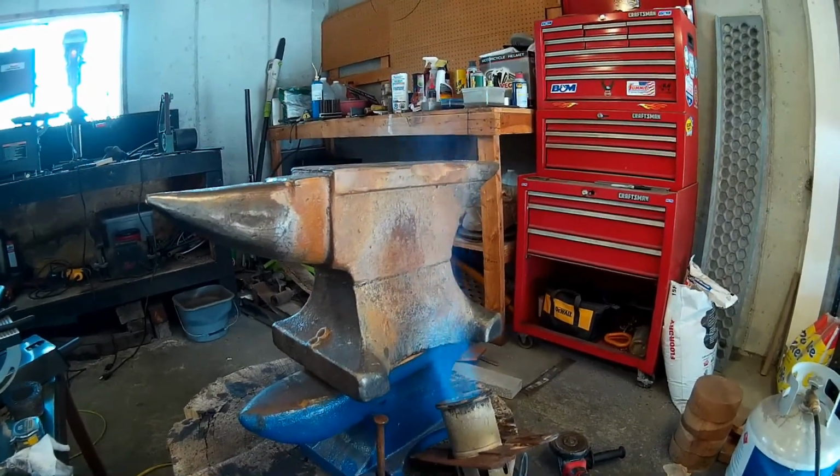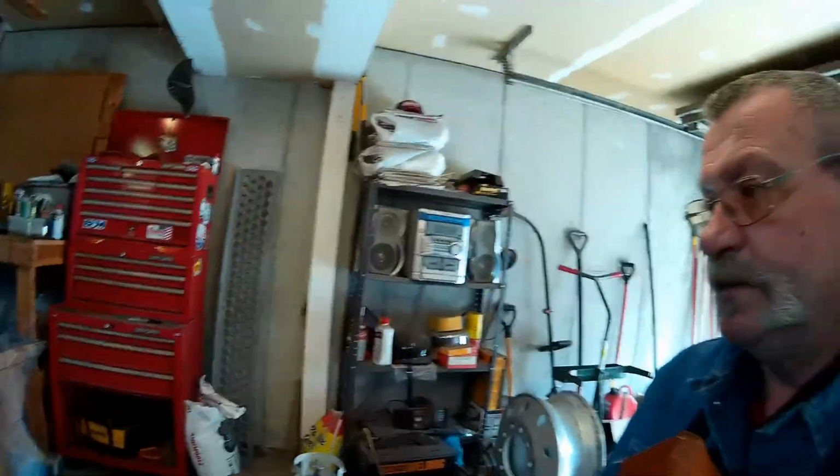And you know, I've heard on YouTube and various other places where I've garnered a bunch of information about this, you know, pros and cons about working on an anvil like this. You'll ruin the temper. But you have to get some pretty good heat in that thing to ruin the temper. I mean, you have to figure when you're using an anvil and you pull a 2,000 degree piece of steel out of the forge and lay it on top of it, that doesn't ruin the temper.